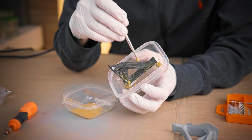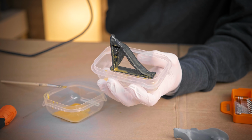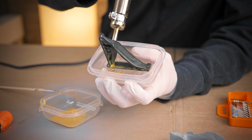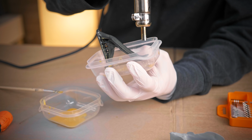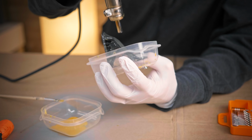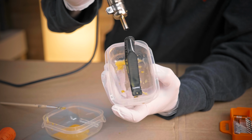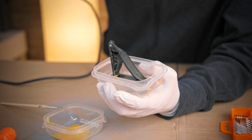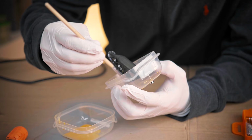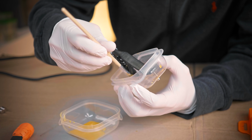So I added 2 more coats on top and always popped it back into the CW1 for a cure cycle between coats. What I'm definitely still seeing is that we're losing quite a few details. Some of these branches are starting to disappear and inside corners are getting rounded out quite a lot. With the hot air reflow station, it's heating up the already thin layers at the surface pretty quickly, but the pools on inside corners and the areas around details just have more mass and more of the base part contacting it, so they're taking longer to heat up and then become liquid.